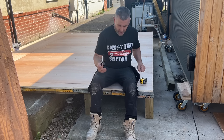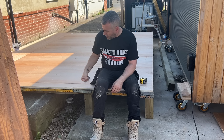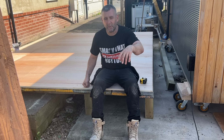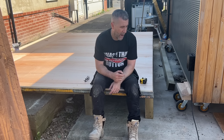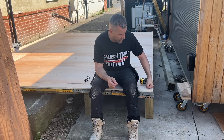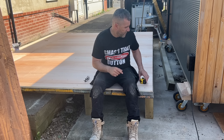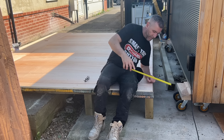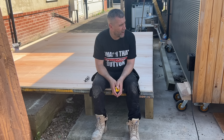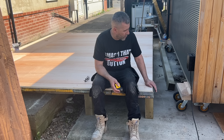You can see where I'm going with this now. I had to buy some fence posts anyway because I'm going to repair the fence once it's across. The ply was cheaper than softwood so I've gone for that - I need ply anyway to protect my astro turf lawn. I also need to create a ramp to get up over here, and I'm going to dump all the muck on the street outside on sheets so the grab wagon doesn't gouge the tarmac. I'm 435 millimetres off my concrete pad and the bottom of the shoe on the building is 200, so I need to get that building up another 235 millimetres and across.